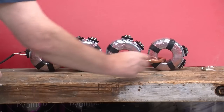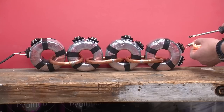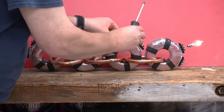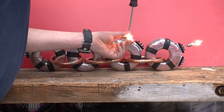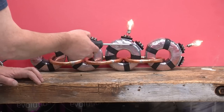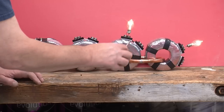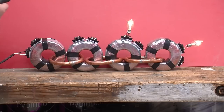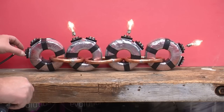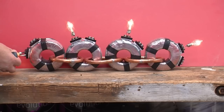Now, there's nothing special about each one of these toroids. So what we'll do is add some light bulbs so we can see what's going on. I'll reattach the light bulb we had down here and add a light bulb in the middle. It's attached to 500 copper windings around the magnetic core, and it's proving to us that there is a changing magnetic flux in that core, as we would expect. And we will do the same thing for this core over here. I'm not going to do that one because this is 120 volts in — so we know what its voltage is. And just so you know, this is through both a GFCI and an isolation transformer.